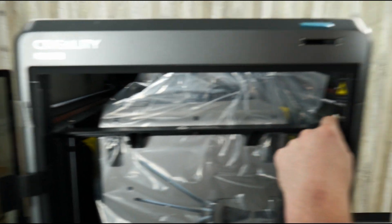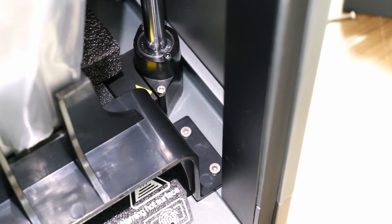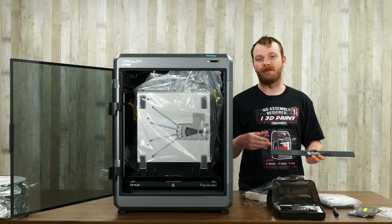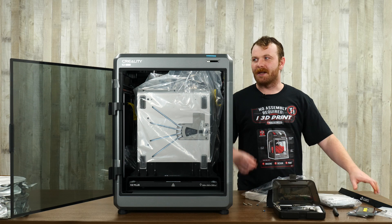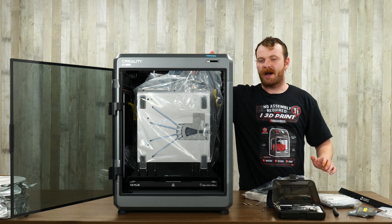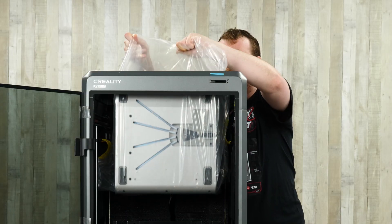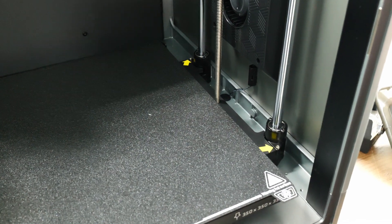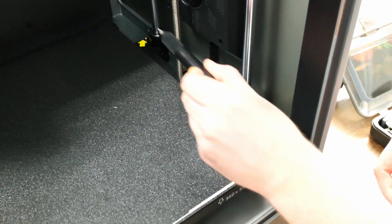For the top, you'll see two screws on each side. On the bottom, there are two screws on each side that are a bit hard to see. Remove the top bracket first, then get in to remove the two bottom screws and remove that little bracket. Once that's done, it's pretty easy to take the piece out. The next step is looking for yellow labels and removing those supports on both sides. After that, look for the four yellow arrows marking screws to be removed. This is pretty common with Creality, but it's important you don't turn your printer on before removing them.